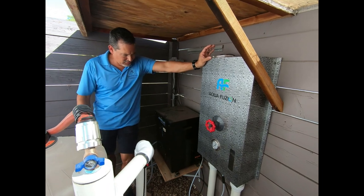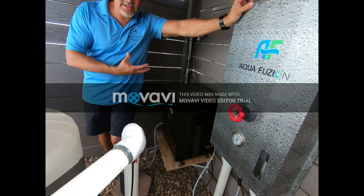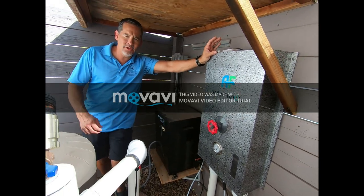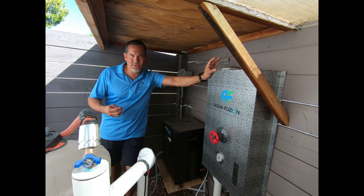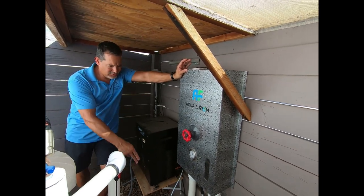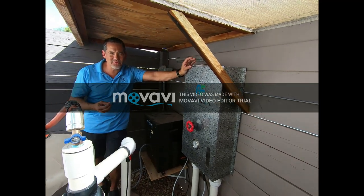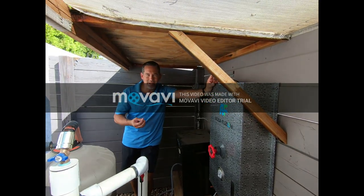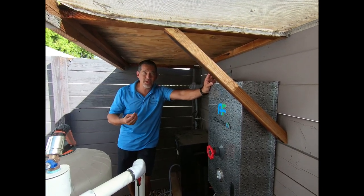We use a medical grade type of concentrator. What the concentrator does is it actually pulls in ambient air and cleans that air — it pulls out most of the nitrogen and some of the other contaminants. You end up with about 94 to 97 percent pure oxygen. We take that pure oxygen and actually inject it through our system here. On the output side, we're actually creating 100 million ultrafine bubbles, or oxygen bubbles, per one milliliter of water. They're super tiny — it falls under quantum physics, so you can't even see them. We're going to show you how you actually measure that.